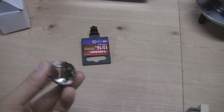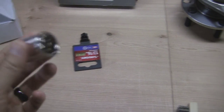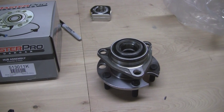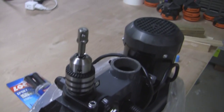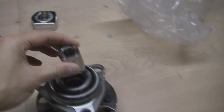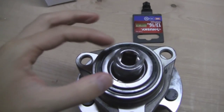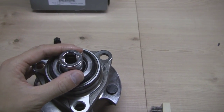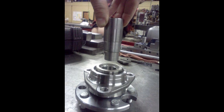In order to make the connection from here to here, I thought about using a socket, and this was the thing that took me the longest time to figure out: how to make the connection to a bearing that's going to provide a good barrier between the wet portion of the pottery wheel and the electronic motor portion of the pottery wheel. So with a socket, I can stick it in here like this, glue it into place. Now, the person online had basically a machine shop, and he could lathe out a steel plug that would fit real snugly into there.